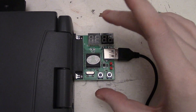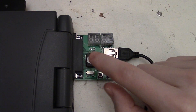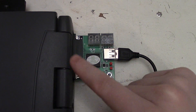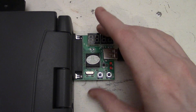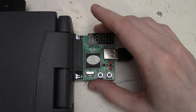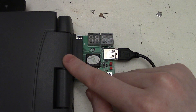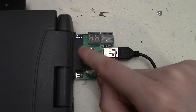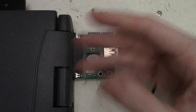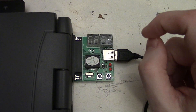After some thought, I remembered that these parallel port BIOS test cards are generally for laptops to get error codes, because laptops don't have the PCI and ISA slots that desktops have. Generally, desktops may not put the BIOS error data out on the data pins of the parallel port, but it makes sense for laptops to do that because of the lack of expansion connections they can use. So I've got it set up on my Toshiba 4090x DVD.